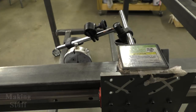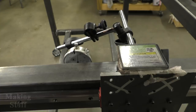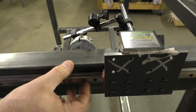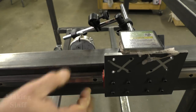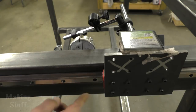So what I think has happened is that the linear rail here, let me zoom out a little bit, has just a little bit of a bow in it. And you can see when I pinch this, it zeroes out. So I'm going to make sure that it's the rail that has a bow in it and not the piece of steel. And I'm going to set that up real quick,